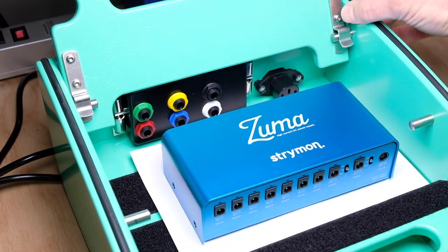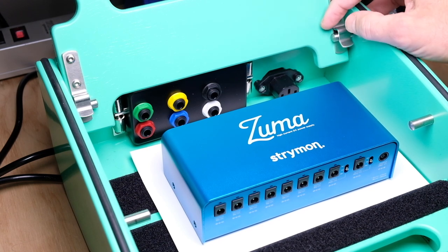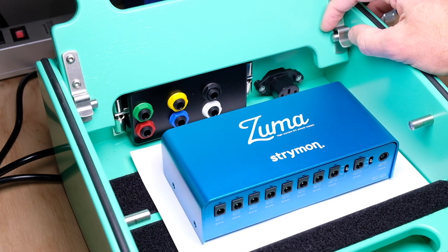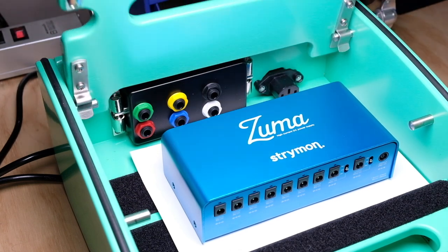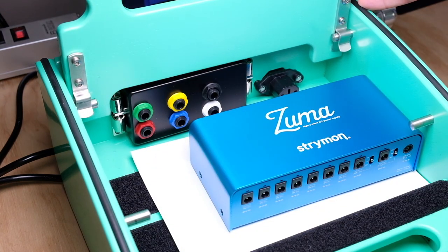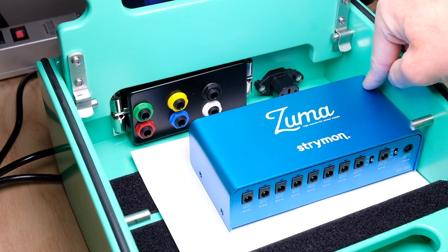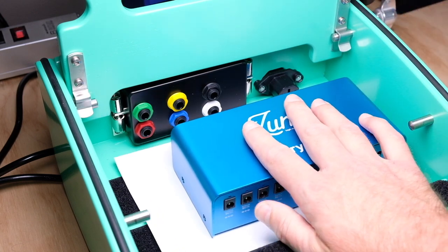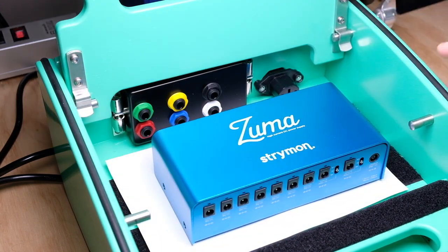Another thing about these boards — this is a smaller board so it has a slightly different hinge design. The larger boards have more of a cabinet-type hinge that comes out pretty far, like a half to three-quarter inch, and they fold. When you push the lid down, they actually come down quite a bit off the surface. What can happen is you get everything wired up, go to close the lid, and it doesn't close all the way because the bottom of the hinge is hitting a pedal or your power supply. So as you're doing the build, make sure you're moving things periodically to check that you're not pinching any cables and the hinges aren't hitting anything.